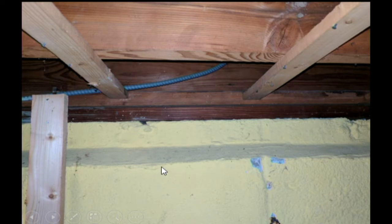As you can see in this picture, where the concrete tapers back it goes up to the sill plate, and the floor joist is right above, with the first floor above that. This is a nice detail with these straps going across for drywall attachment, and you can see the original drywall furring strips and a random electric wire. His question is: how do I finish off this area? He imagines the InsoFast would run straight across, leaving a three-inch gap that he's worried about.